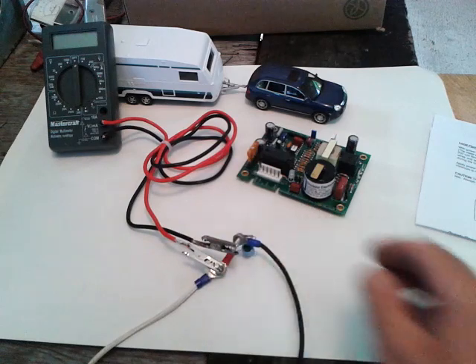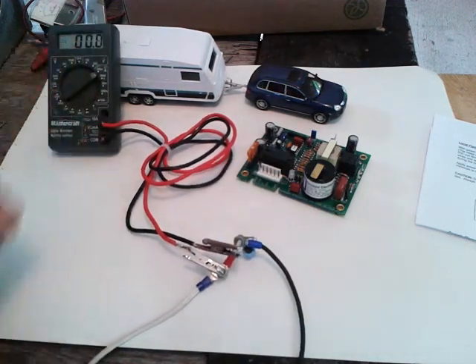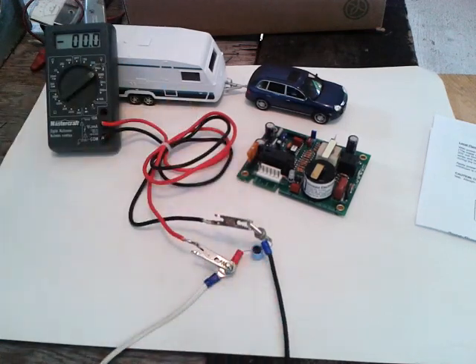I think we're ready to fire this furnace. Keep your eye on the meter — we're going to set it to 200 microamps. I'm going to call for heat on the thermostat. We don't want a spark to jump there, so we'll keep a little bit of distance between the wires.